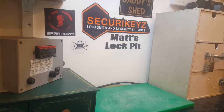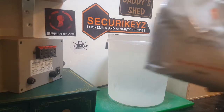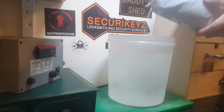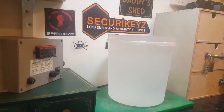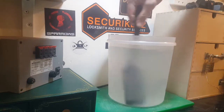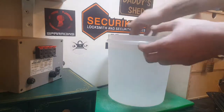The electrolyte solution is just a bucket of water - I've got about four liters in there. All we need to add is some sodium carbonate, which sounds complicated but in reality it's just soda crystals. I bought this from Wilkinson's for about £1.50. Add a little bit in - it doesn't need much, well according to online anyway. I've never actually done this myself, this is the first time, so we'll see how it goes. Make sure that's nice and dissolved.